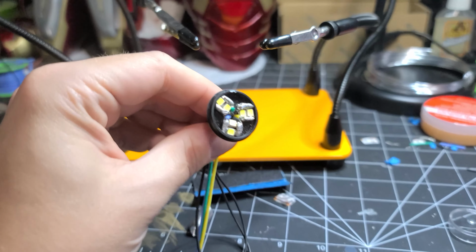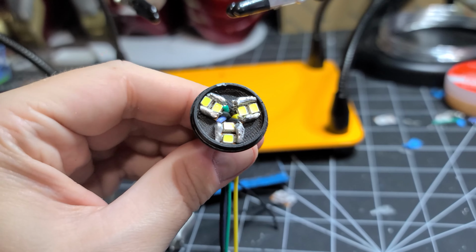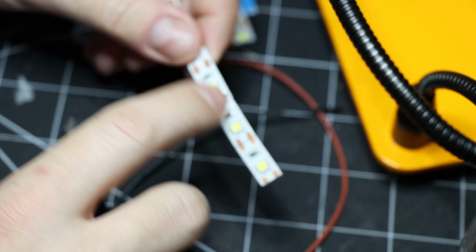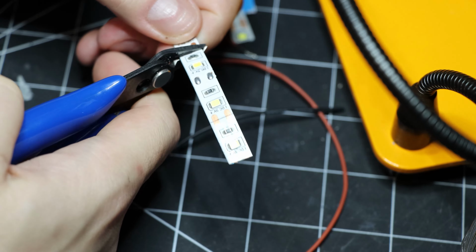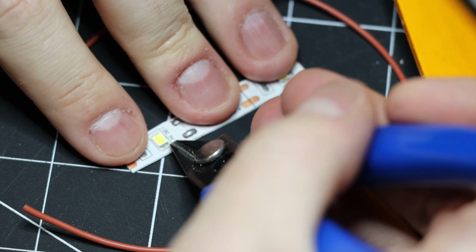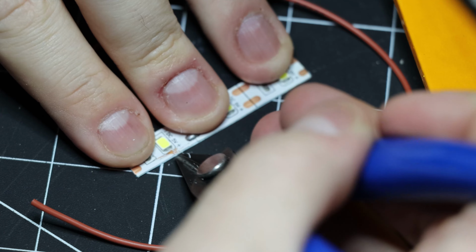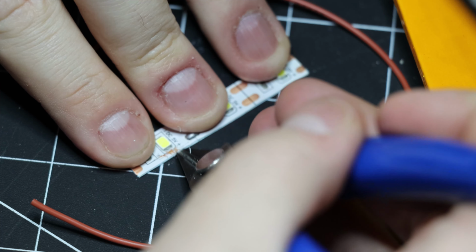The next step was to start putting together all the wires and LEDs. Now, I was a complete newbie when it came to doing this, as I had never soldered a single thing before this project, but I promise you, it was actually much easier than I thought it would be. The idea here is to cut LEDs off of a light strip and wire them up together. In order to do that, I had to scratch off the white paint next to each LED to reveal the copper that runs along each LED. This will allow you to attach solder next to each LED.